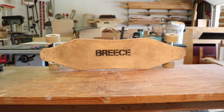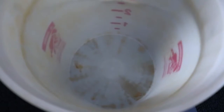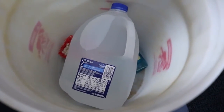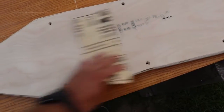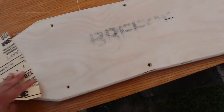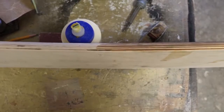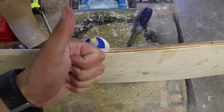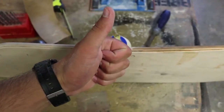This deck was so dirty from me riding it around for about a month that the first thing I did was take a scrub brush and some soapy water and cleaned it really good. Then I went over the deck with 80-grit sandpaper with my palm sander, and then I went over the edges also with 80-grit, and then went back over it and got the thing smooth to the touch with 120-grit sandpaper.